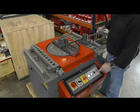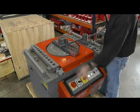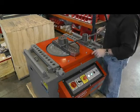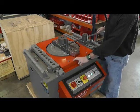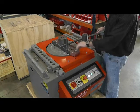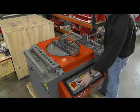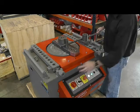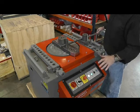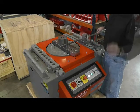A side note about the directional switch: the number one position will bring it clockwise, and number two will take the direction counterclockwise. When you start and wire up the machine, you want to make sure it is in phase. Therefore, when you do your test bends, make sure that if it's out of phase and you're in number one but it goes counterclockwise, you know you need to change the phase. It's a safety measure to ensure the machine is going in the direction you want it to go.